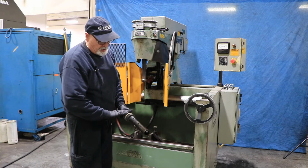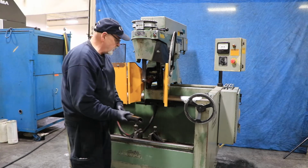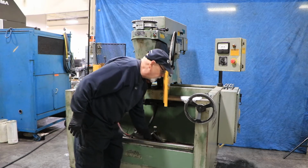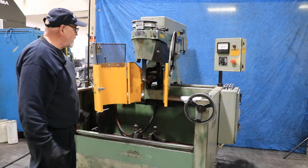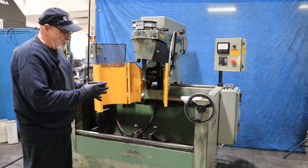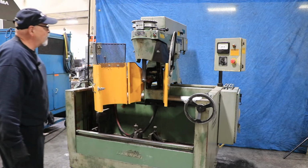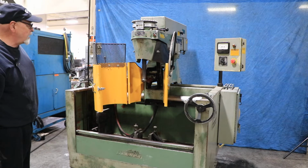This has an adapter here to accept this type of honing head. This is the same type of honing mandrel you would have on a regular horizontal type Sunnen hone. Normally the Cylinder King or the CVs have a CV type honing head, which is like a forged stone, kind of a boxy looking thing that is made for grinding, honing cylinders. So you got the catalogs to pick stuff like that out with.